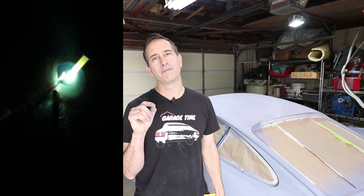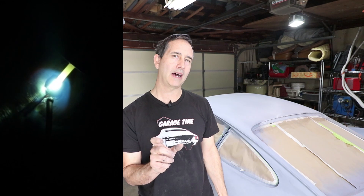Number two in my how-to-be-a-better-welder workshop is TIG weld it. I'm going to be demonstrating and allowing you to practice things like arc length, variable weld current, where to start the arc and where to stop the arc, and things like travel speed. The more experience you get, the faster you can go and the less heat input there is. Depending on your level, we will start very slow, or if you're more advanced, we will work on moving quickly and reducing the heat affected zone.